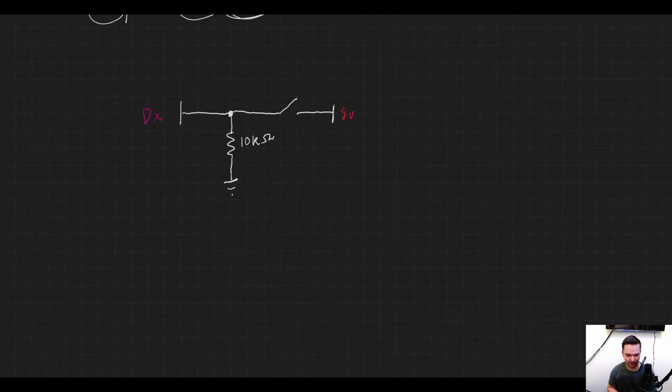We talked about previously how this mitigates our noise issue, where if we don't have anything connected to it, we're not going to get a lot of interference, and it's going to know that we have a reference to ground. So we know exactly what 0 volts is. And if we're getting 5 volts, then we know for sure that it's not 0 volts and that we're not going to get this floating signal.